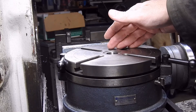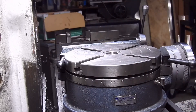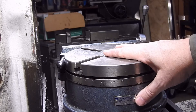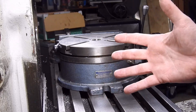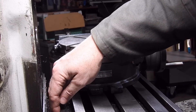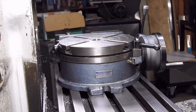The same holds true for rotary tables as well. As you can see, I'm getting very close to the back — this is an eight inch rotary table — and I can't use the locking lever on the rear because I'm that close to the column that it's interfering. Rotary tables also get really heavy the bigger you go. My rule with rotary tables is you want one which is equal to or a little bit less than the width of your table. For a vise, check the manufacturer's specifications, but you want something that won't protrude past the back of the table much, and opens enough to machine without excessive opening, since the spindle can't get there anyway.